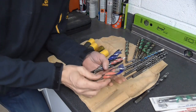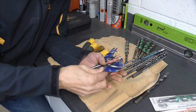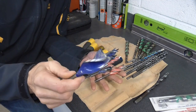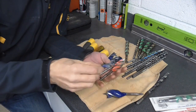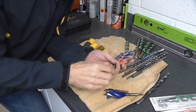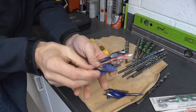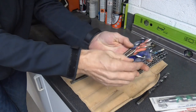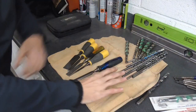I've also got a few of these super rough drill bits. If I've got anything really rough to do where I might hit a nail, I just butcher my way through with these. You can see one has part of it snapped off, and this one I've cut down really short so I could get into somewhere tight — same with this one. These are particularly aggressive — I wouldn't use them for any fine work — but for just bashing a hole through, say for running some wires, I keep these tucked in a corner of the van and find them really useful.